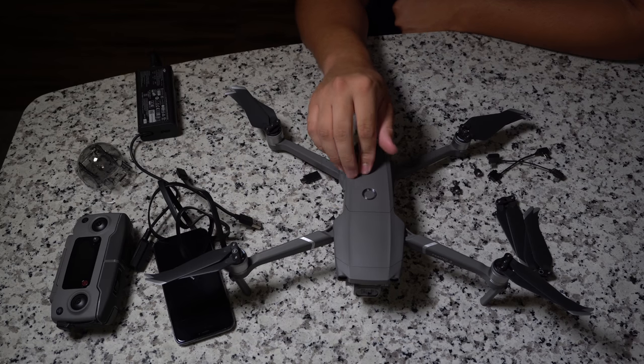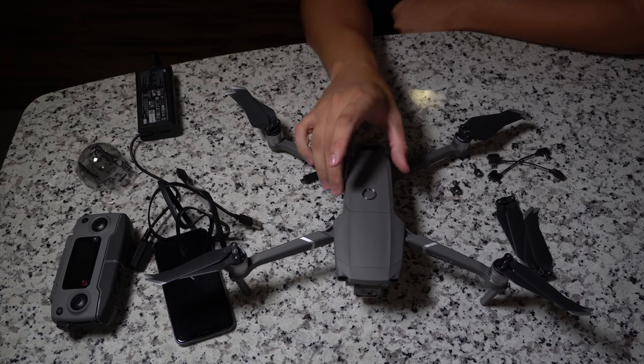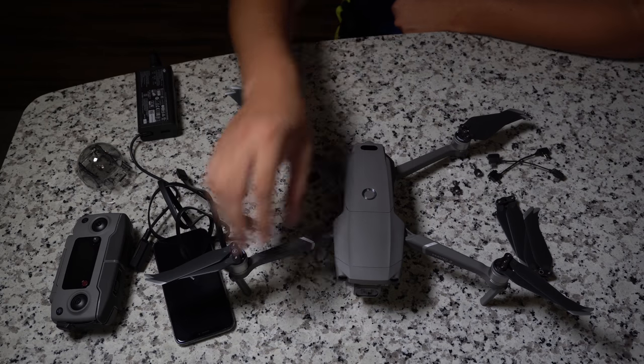We've gone over the drone, the app, and updated all the firmware — everything should be good to go. Keep in mind there may always be a new firmware update, so it's good practice to turn on your drone, app, and controller, get everything synced up, connect to the internet, and check for updates before you go out to fly. If you fly without checking and it finds a firmware update, it will force you to update before taking off, which is inconvenient. Also note that batteries sometimes get firmware updates too, so if a battery firmware update is available, make sure you do it for all your batteries.